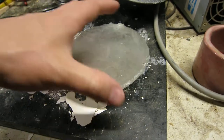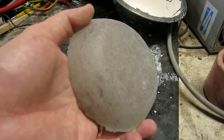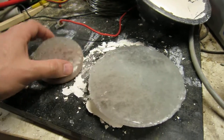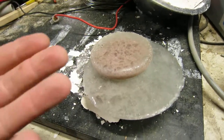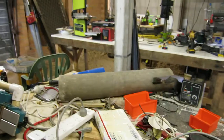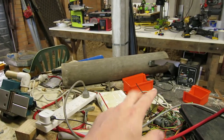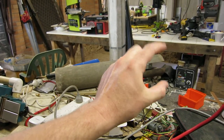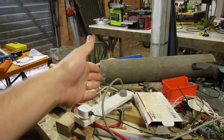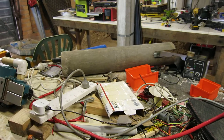So I want to take some photos of these, grind down the edges, and then do some drop tests to see how well they tempered. My plan for the drop test is just to set it up on concrete and then have some mechanism that would evenly release at the top so it falls down towards the ground - that way it's a set distance that it falls, and the tube will catch all the fragments when they explode.